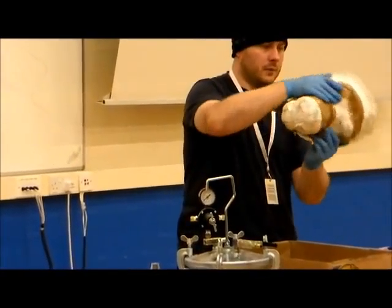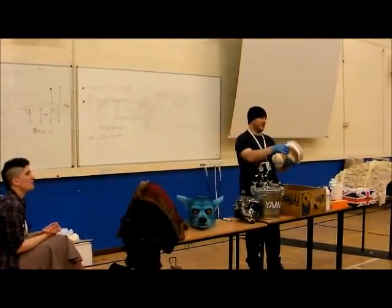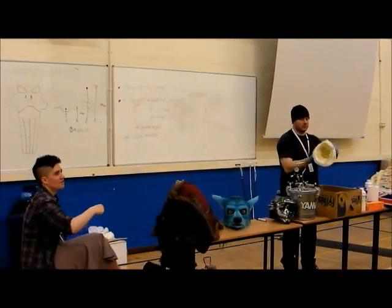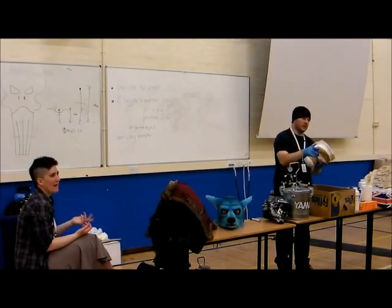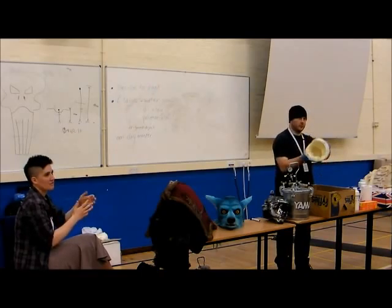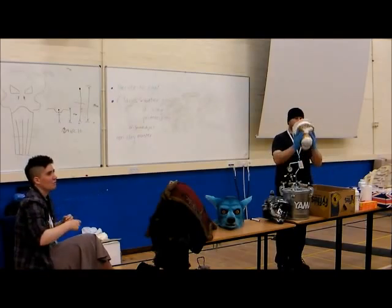Can you paint resin? Yes, when you've got a layer on. But there's the risk of it curing so much that you pull it away from the mould while you're doing that. But could you use, instead of a paintbrush, a spatula? Again, there is a risk. Because it becomes sort of soft and slightly gooey, there's a risk of it catching on itself and pulling the whole thing away from the wall.